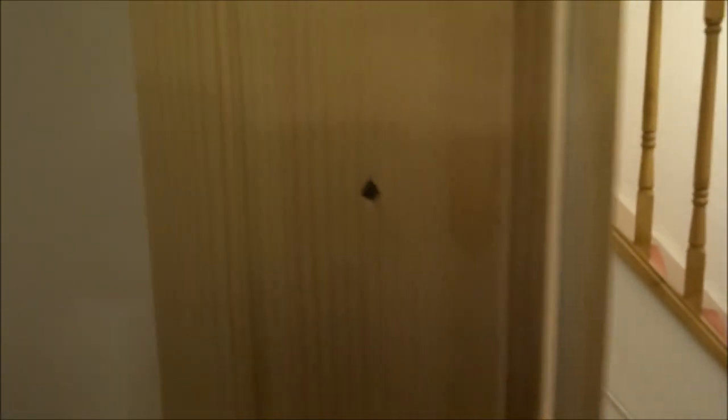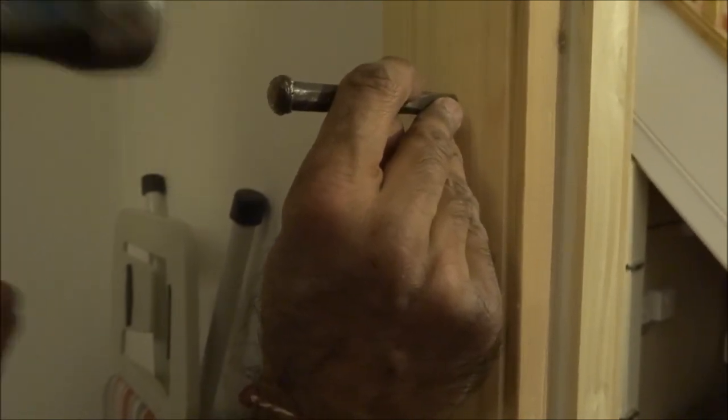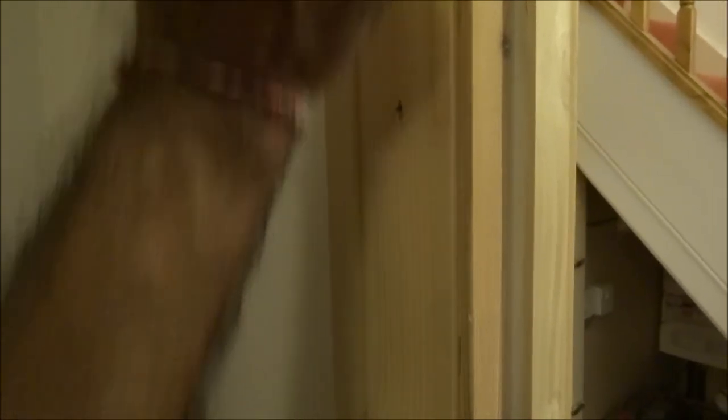It's pretty straightforward. I've got a mitre saw. Just cut the angles and stick it on. Any gaps, just use wood filler and fill it in. Normally I prefer to nail in the architrave. You see I've nailed it in there, but you don't really want the nail to look like that. So what you do — if you move back a little bit — you push it in like that, and then you just fill it over.